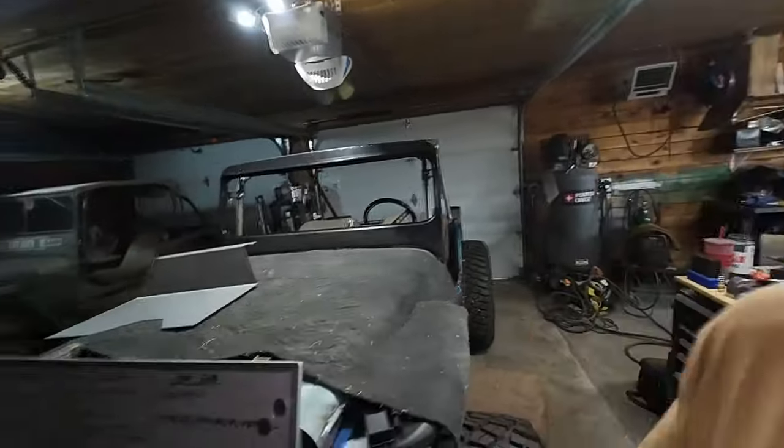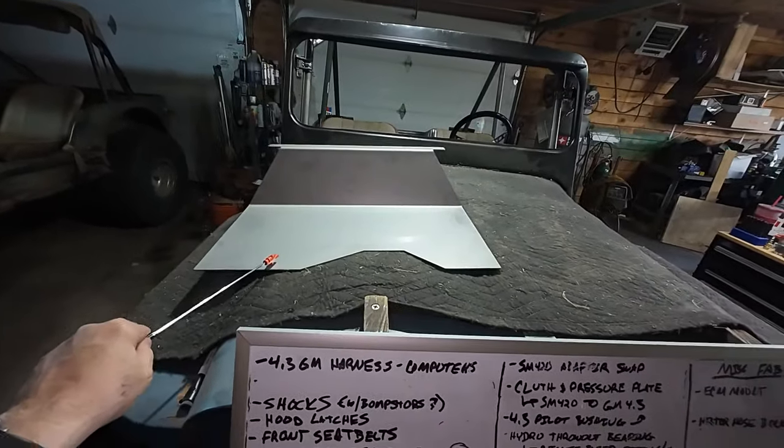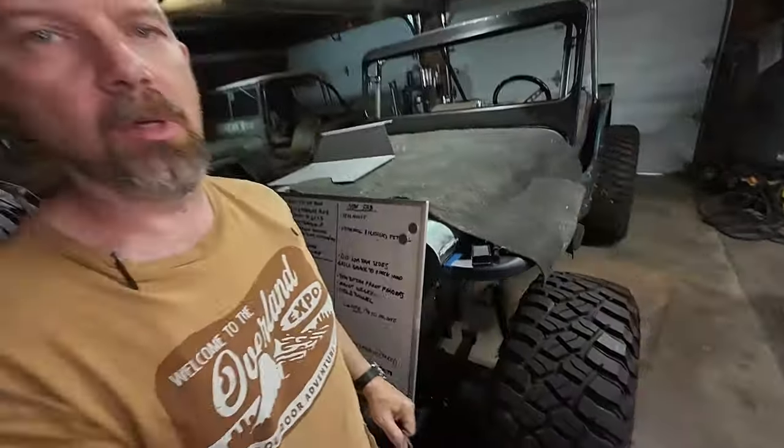Other than that, it's just a lot of welding. I probably have another two sessions — about three hours of welding is enough for me and it's starting to get warm in here. We'll do most of the other seams tomorrow, depending on how much heat I have to put in and how it starts to move around. This is the skid plate — eighth-inch stainless steel that goes on the bottom of the tank, and that needs to get welded on last. Brackets and fittings are almost done; the filler tube still needs to be welded on.